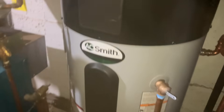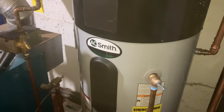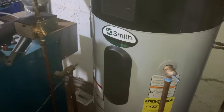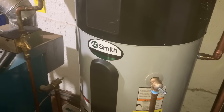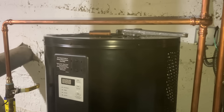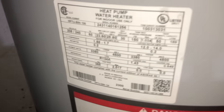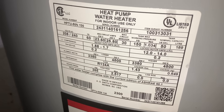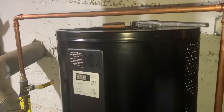I really love AO Smith products. For every time we install an AO Smith water heater, I buy one share of AO Smith stock. It's nice and not that heavy. All I have to do now is let it fill up, get all the air out, then hook up the electric, clean up, put our condensate where it needs to go, and have a nice day.